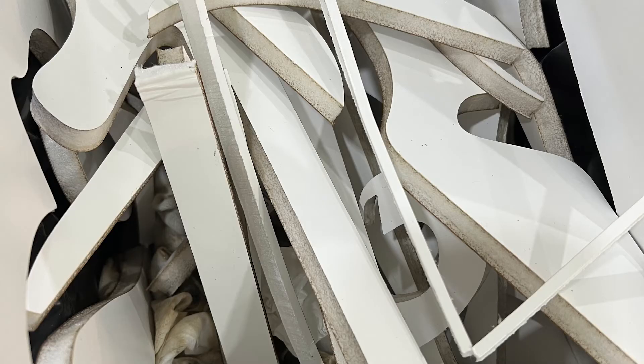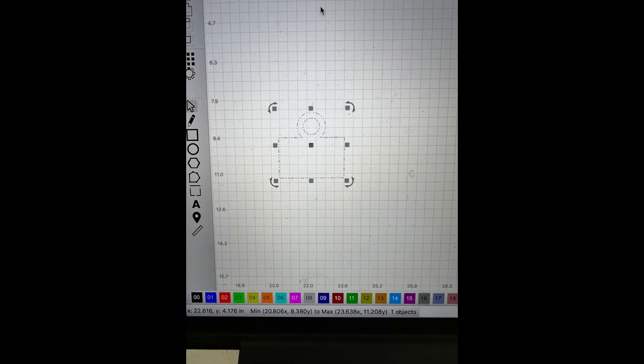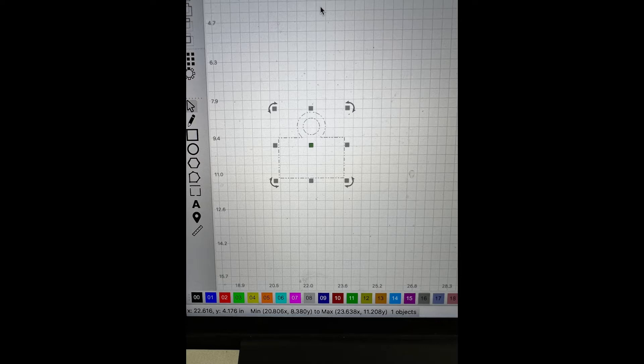Several people have asked what the sides look like. This is an example of what you'll see — a little bit of brown from the laser, but the foam stays pretty intact. It's maybe one-twelfth of an inch indented, but you don't even see it. I'm going to show you how to paint it. One thing I like to do with all of my foam boards is use clear acrylic to create hangers. I go into LightBurn, create a square or rectangle with a circle hole, unite those, cut them out on the laser, peel off the paper, and use those to hang the boards.